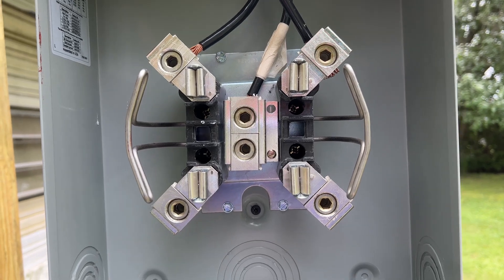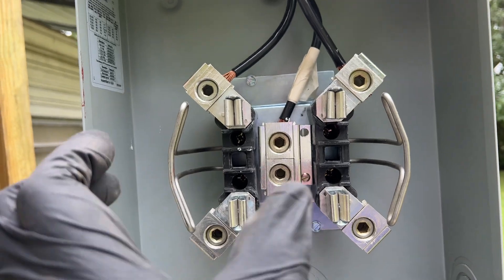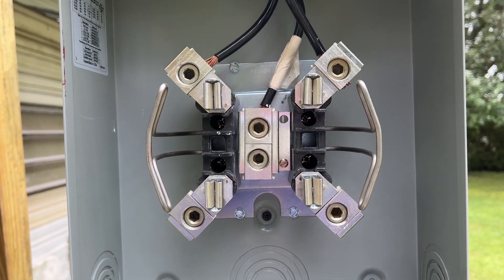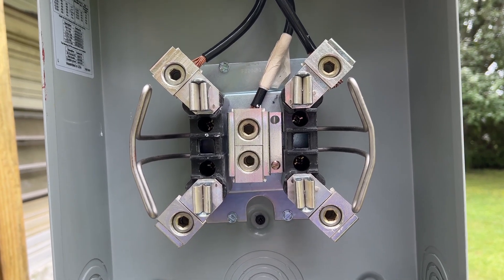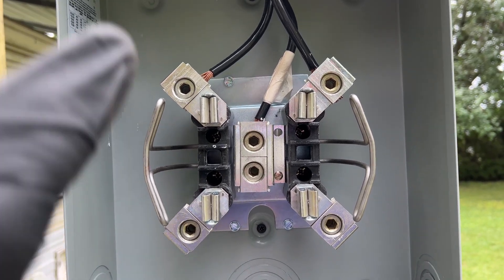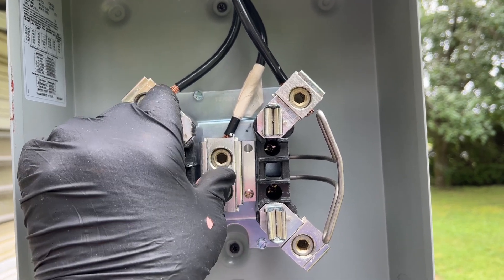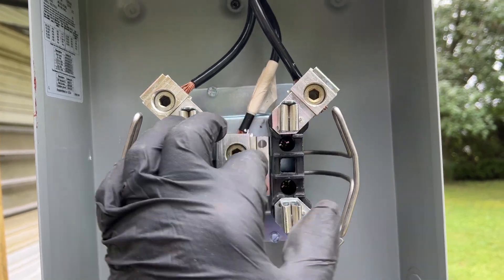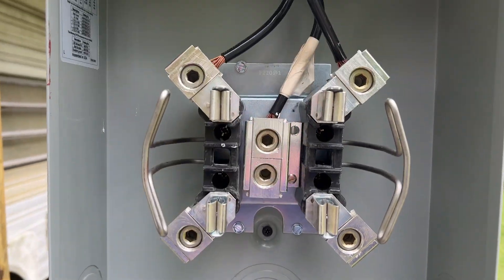And if you've got a big panel, a lot of times down there you'll have different circuit breakers on one side or the other. Keep in mind, you really need to stagger them so you don't offset the transformer too much. I wouldn't just load one side up, even though it is 120 volt. You don't want to load one side of the transformer up — you want to keep it balanced: one here, one there, one there. I'm talking about when you get down to circuit breakers.